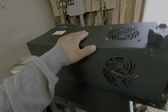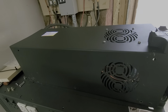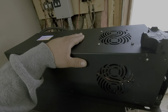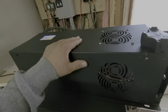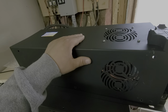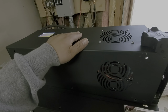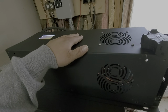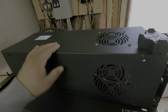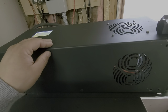This inverter is capable of five kilowatts continuous all day, all night, but it's always good to give yourself some headroom. If you purchase an inverter like this with the intention of always having five kilowatts on it, the fans are going to be at full peg all the time and, depending on your ambient temperature, it's going to be spewing hot air. I would still recommend that you stay between 50 and 75 percent of the rated load — that's what I always recommend to my customers.